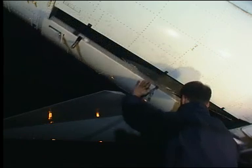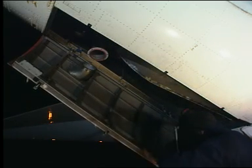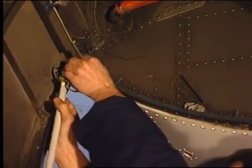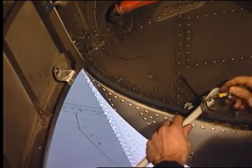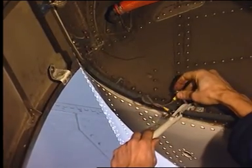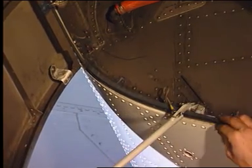Control the downwards movement of the door as it opens. To keep a door in the fully open position, remove the quick release pin, install the support strut by disconnecting its upper fitting and connecting it to the related fitting in the APU compartment. Then install the quick release pin.